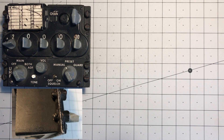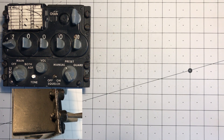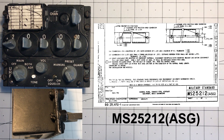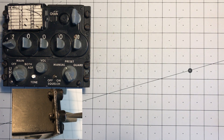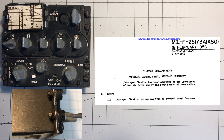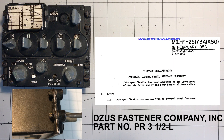And now here's a little information on some military specs for these type of panel and the fasteners used. I found MIL-Spec MS25212, which is about control panels, basic dimensions — seems relevant even if it doesn't exactly match the dimensions of this panel. Another specification, MS25173A, is just about one type of fastener used. That mentions a company, DZUS Fastener Company, and a part number PR3-1-2-L, or equivalent. So some interesting and potentially useful information in those military specs.